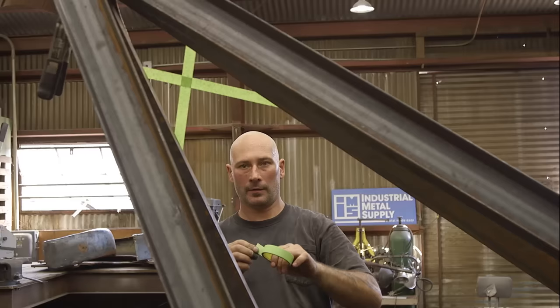For the windshield frame, Don had this really neat oval tube — I don't know what it's from, but I think it'll serve our purpose perfectly. On this cab, pictures from the Internet show the windshield is about this tall but it just sits up inside. The roof is way wider than the windshield — they were never intended to match. It was more like an air deflector, a wind shield — it just shielded you from the wind, and that's where the term came from. I'm going to TIG weld all this because it's going to make a nice little weld bead. Hopefully I won't have to sand or do any detail work — it'll just be a nice stainless steel TIG weld.